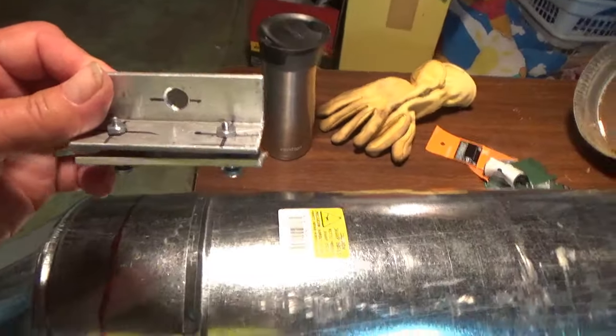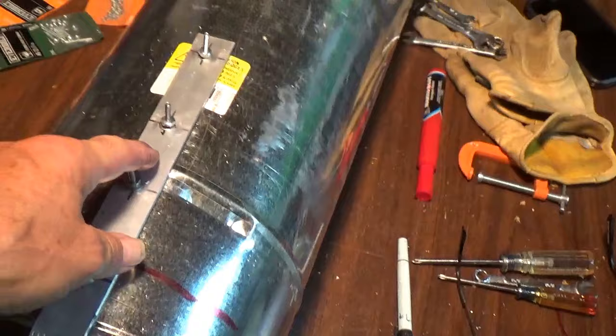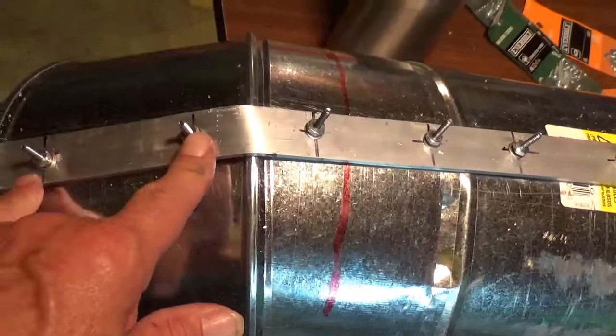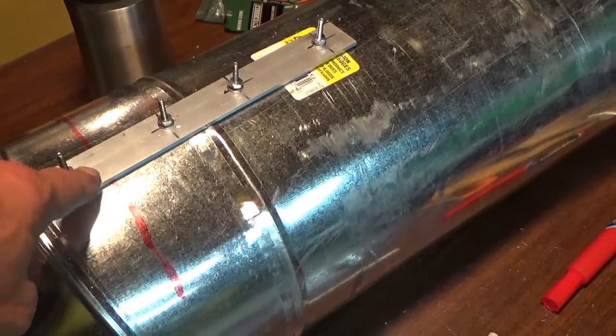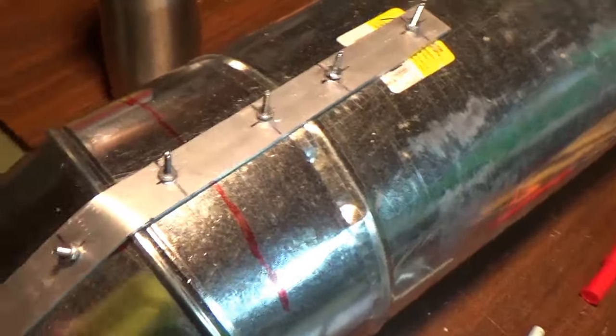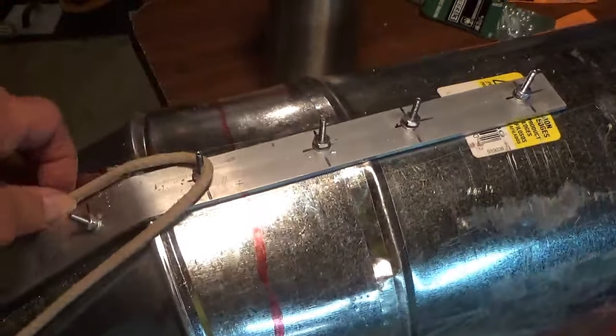Alright, so I've got to make another one of these too. Let's have a look. I'm going to take my glasses off so I can actually see how I'm doing this. So this is an eighth inch thick, one inch wide aluminum flat stock. I bent 30 degree angles, and then I put 6-32s by one inch long screws. I put them from the inside so these things don't impede chip flow and also don't get hit and cause torque and rip out. The inside should be as smooth and unobstructed as possible. And the benefit of having these stick up is I can hang the rope right up on there — I don't have to make another bracket.